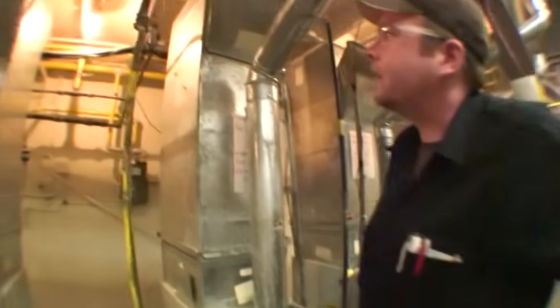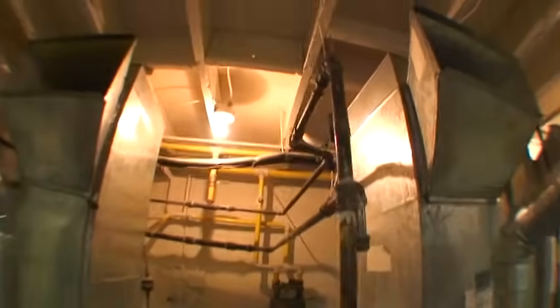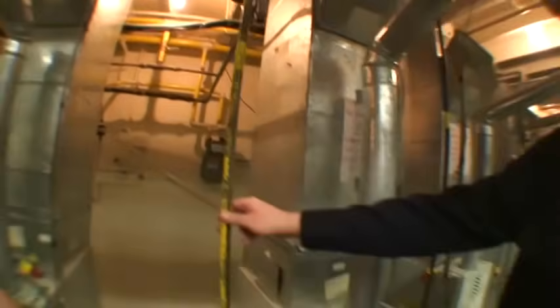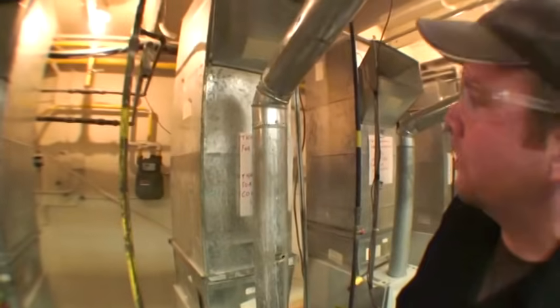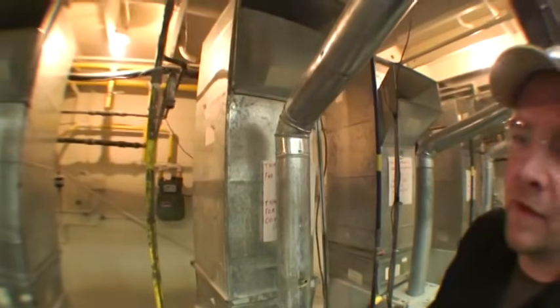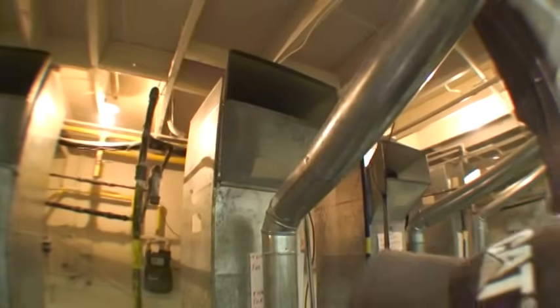Another code thing that is incorrect is the support on the piping. As you can see, it's fairly sloppy, and there are different codes as to supports spacing for pipe diameters. And the ductwork — minimum code, I believe, is five feet of ductwork and return on the furnace, which we don't really have on this furnace.